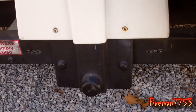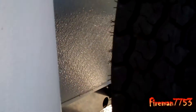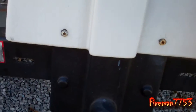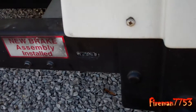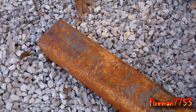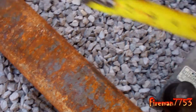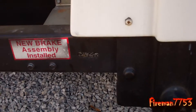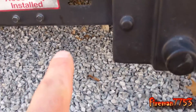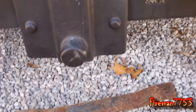So we're fabricating. Here's my thoughts — it's a small boat and this is a pretty heavy duty bumper, attached at various points right there and there and there. There's a couple of spots here where there's already holes and there's nothing back there. So I started digging through all my scrap and I got a bunch of angle like this, bunch of little pieces, and I got this piece of three inch square stock. I can make a couple of brackets, bolt in here, come straight back, then put that square stock across the top and then put the hitch to that.